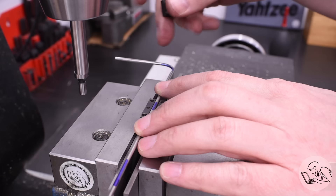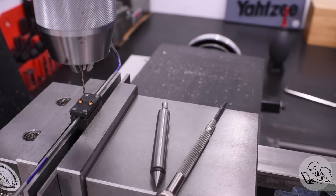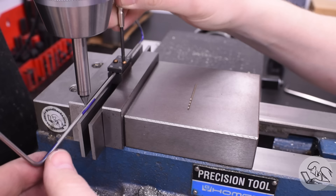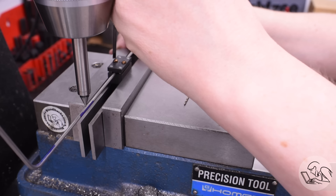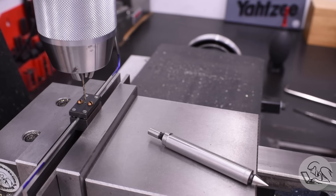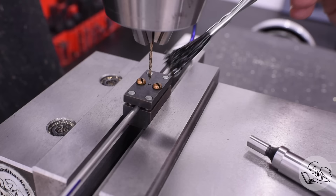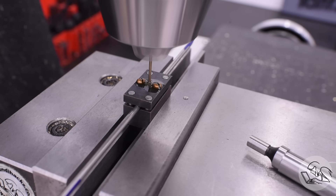I need to cross-drill holes through the top rail to pin the stanchions in place. I needed a very special fixture for that, which I happen to have because I made it and covered it in a previous video. I centered up on Y with the edge finder and on X I centered up on the hole in the fixture with the drill. I zero the DRO at the first hole, because now I need to move down to the mark for the other stanchion — I can't see that mark since it's inside the fixture. So I move down the correct spacing on the DRO, then slide the workpiece in the fixture until the other mark lines up with the pointer, then go back to zero on the DRO and I know the hole will be in the correct place. I'm also careful to align the stock so the stanchions are vertical.